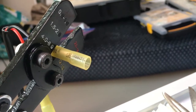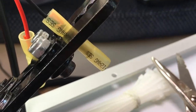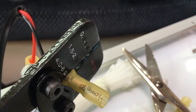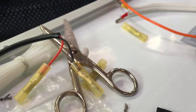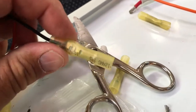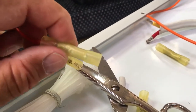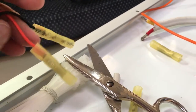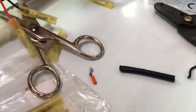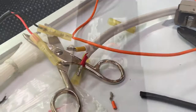Second try — I curled up a few more wires on the black and it's a little thicker now. I'm going to give it a good crimp. You always have to give it a pull test, because if it comes off now it'll come off at a bad time later. That side is done, and now I just need to put on the heat shrink.